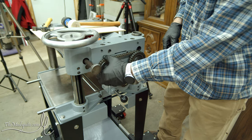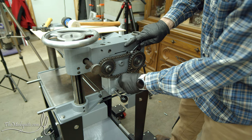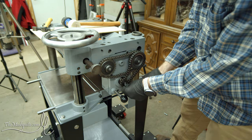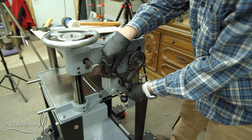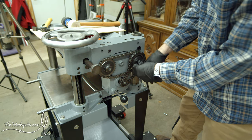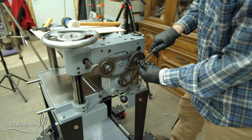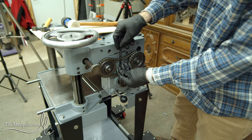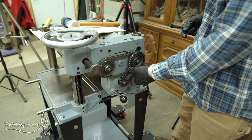There are two screw holes up here that I could have drilled and tapped myself and bought a tensioning sprocket from Grizzly - I think they use them. But I thought if it didn't have it originally, I'll try it without and see what happens. If I decide I need to add a sprocket there for tensioning, I can probably figure that out pretty easily. There's just one cover to take off and this end is pretty well exposed - it's the other side that would be way more obnoxious.